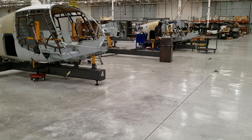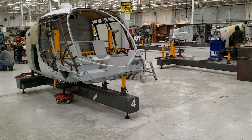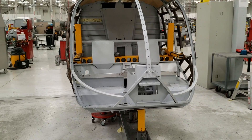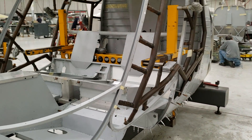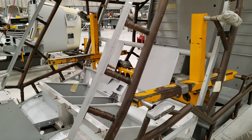This area here is brand new cabin construction. In the front we have the R66. This is a brand new R66 cabin, so you can see it's mostly made up of light pieces of aluminum, stainless steel, and there will eventually be some fiberglass — you'll see some on the roof there.